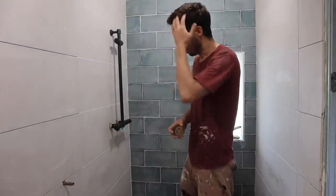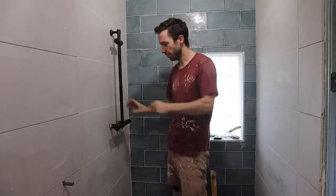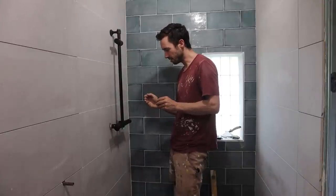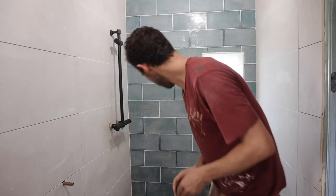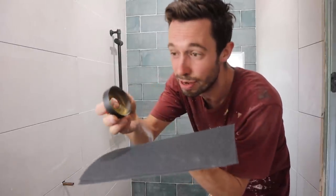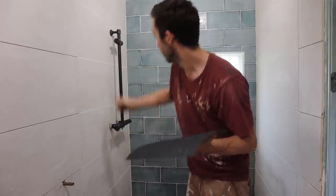At the moment I am trying to install the shower. It's a little tricky because the pipes go through the wall - they're inaccessible and at some point need to be shot into the wall. Getting the precise measurements, I've probably gone about two millimeters too far in. What covers up the bit behind it are these little cups, and I'm going to have to use wet and dry paper to very carefully take down two millimeters, keep checking it, then smear it all up with silicone behind it.